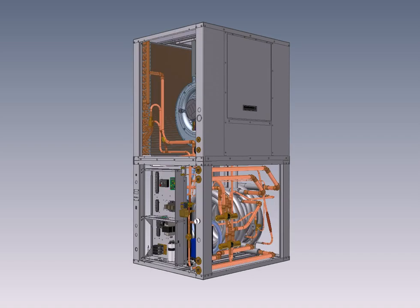The selected water coils are also the toughest on the market with the best freeze resistance and best tolerance for solids in the water. Water coils are available in Copper Nickel as an option on the outdoor side for open-loop well water that is high in chlorine or salinity, and on the indoor side for heating a residential pool, for example.